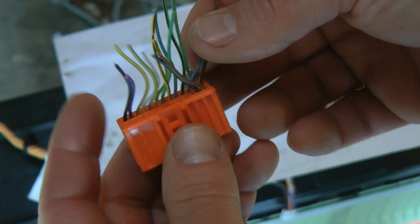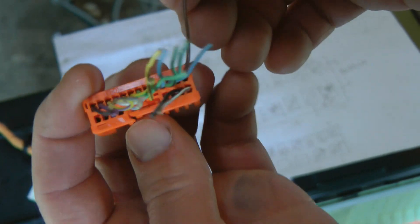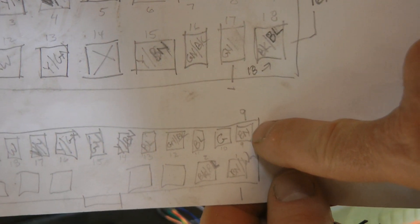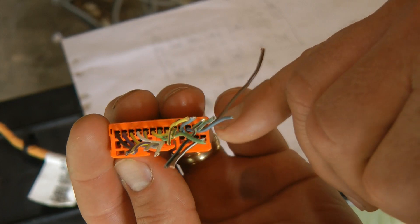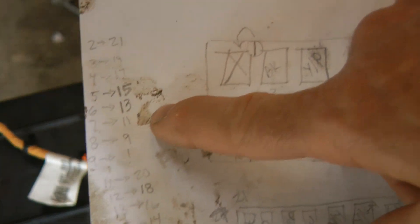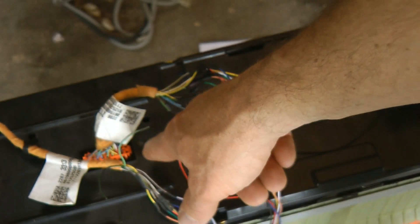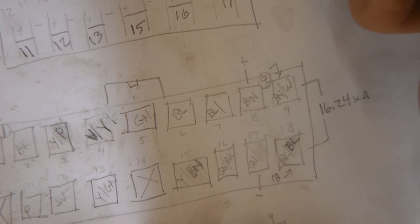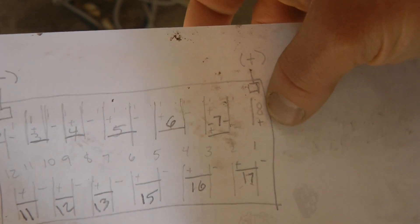So I'll get a close-up of the wiring and put together a little chart. This is the end that would plug into the box on top of the battery. You can see here's the diagram of that part — the one way over in the corner is brown, and that's pin number nine. That corresponds with pin number nine here, and nine on that end corresponds with the eight on the plug that's going into the battery.